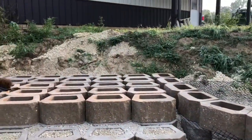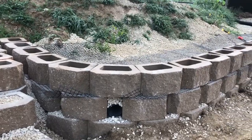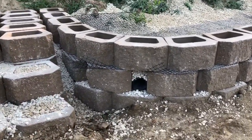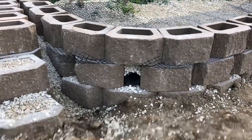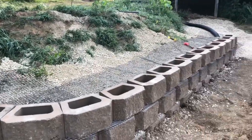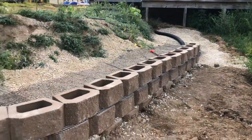We have to break the lip off the back of them for a lot of the steps, but a lot of them are already broken off, so we're making do. I know they say if you properly design a wall, you don't need a drain, and I'm hopefully doing that, because that is clean rock — that's not road rock. But I thought, let's just put a drain back there just in case.